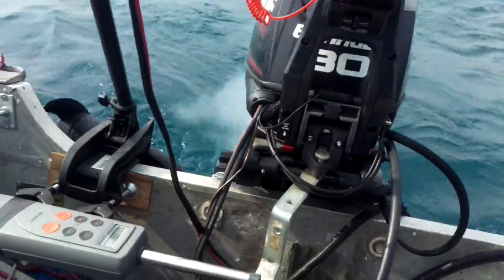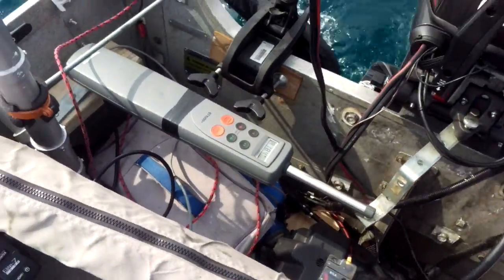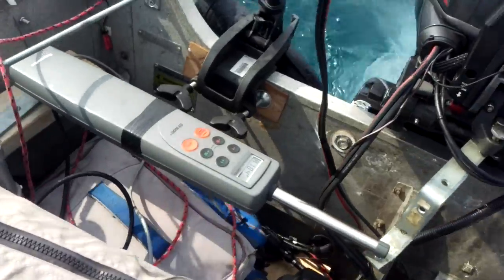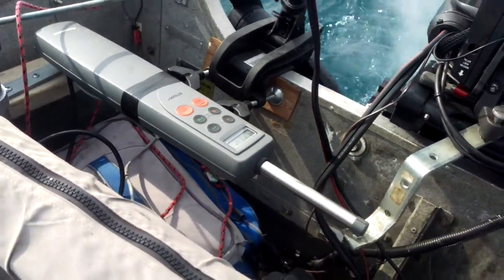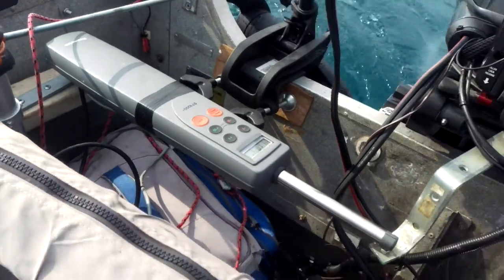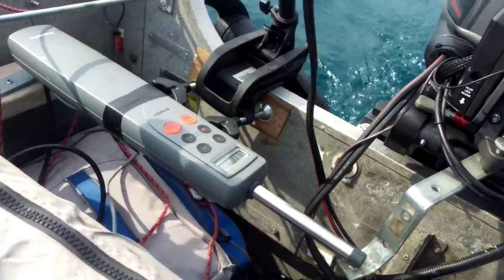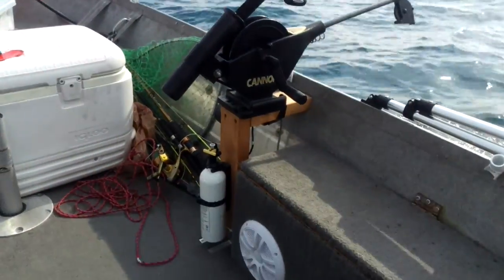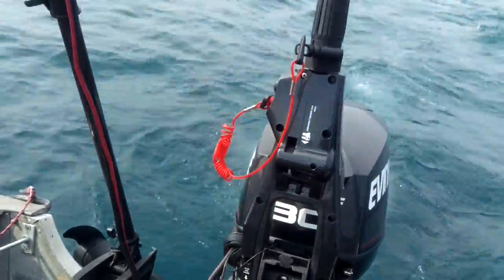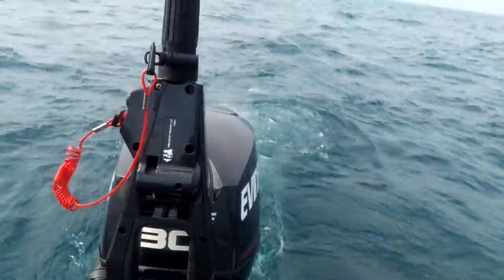Autopilot. This is a Sailboat Autopilot Tiller, Model ST1000 Plus. I removed the flux gate compass out of it and installed the flux gate compass up front so it doesn't get any magnetic interference from the motor. Works perfect even in choppy conditions — great for Lake Michigan.